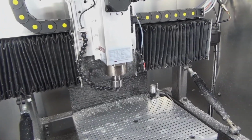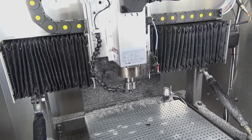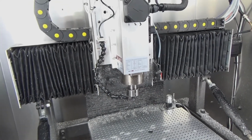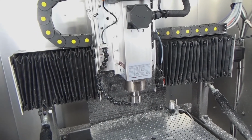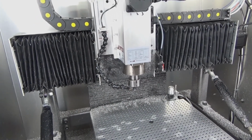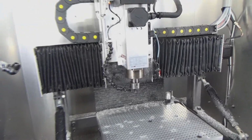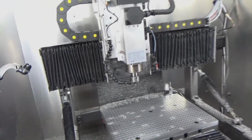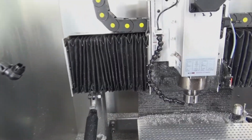I got the layout of the folds from a simple piece of software that is online. I can get the link to someone if you're interested. That gave me the dimensions of the layout, and I basically just drew that onto the craft paper, and then you have to hand fold the bellows. Clamped them in place after they were folded for several hours, for a few days, and they worked pretty great. They were a ton of work, but that was really my only option.